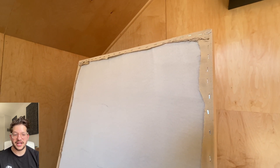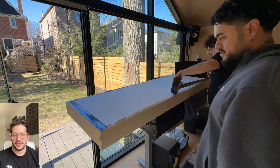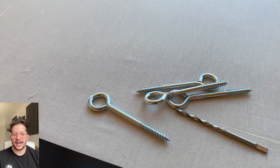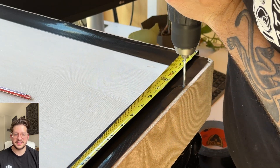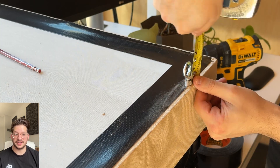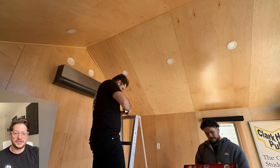We have our six cloud panels on site now, and we're finishing up some edges where the fabric lifts — just taping everything down for a nice detail touch. It doesn't affect acoustics, it's purely aesthetic. Here are the eyelet screws we are using to go into the panel — I use nice long ones to make sure I'm getting a lot of threading for a secure and stable mount. I'm drilling four inches in from both sides of the frame, right in the center of the plywood, completely perpendicular to the wood frame so I'm not poking out on either side.